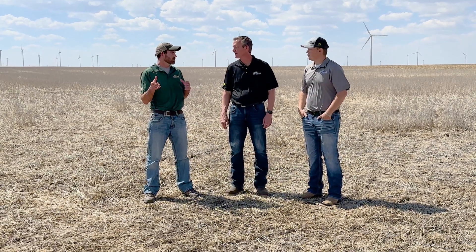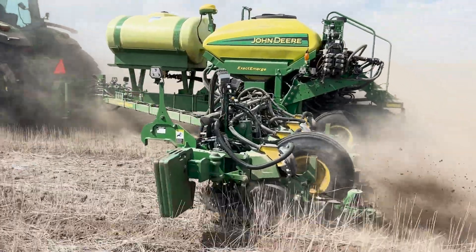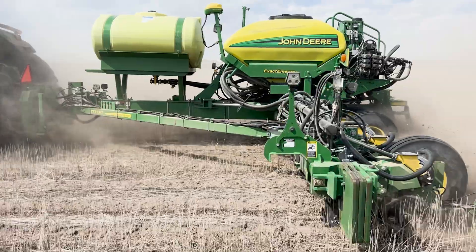Some background on the iRHD: the 2.0 is an all-new John Deere design. What we refer to as 1.0 is the old Dawn design that's been out for quite a few years — that system has had some highs and lows with rusty rods or bad accumulators. The 2.0 is pretty much a whole redesign from the ground up with a completely different look, feel, and accumulators that are less prone to failure. And it's a puck kit too, so if you have iRHD 1.0 we can upgrade it to the new 2.0.